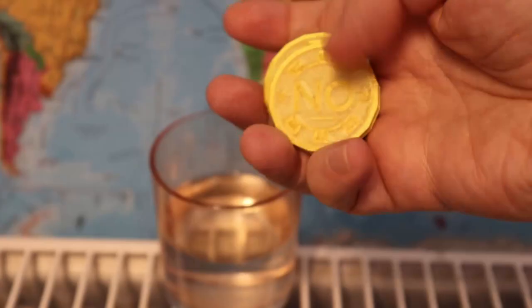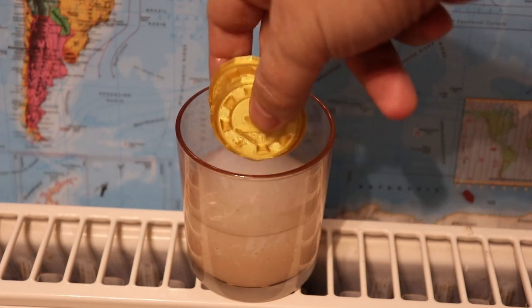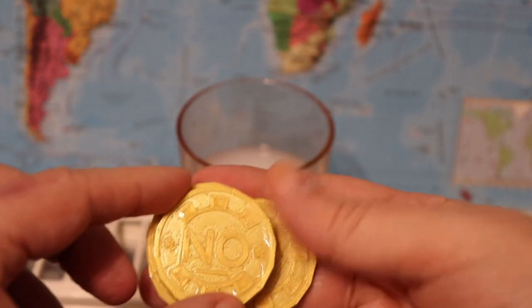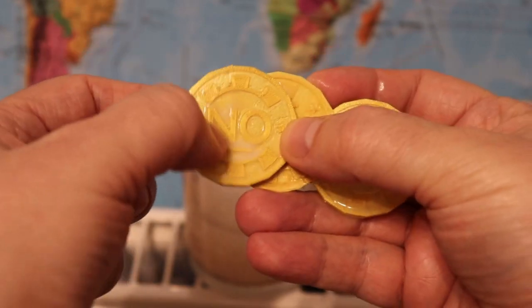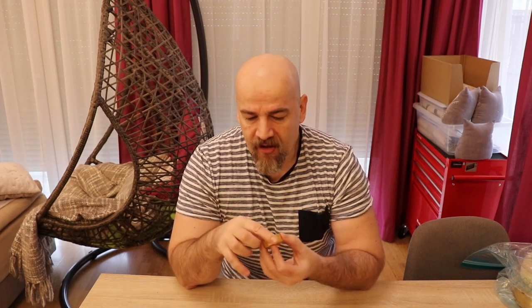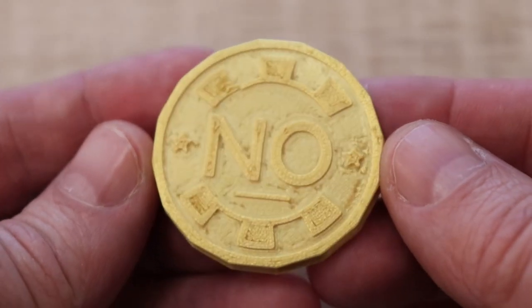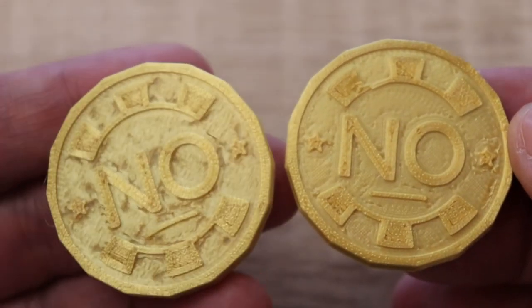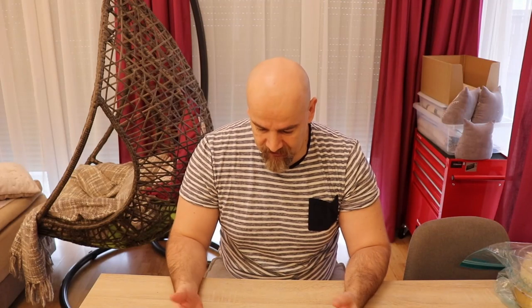Let's place all these coins into water. After three hours it's almost done. And here they are — version 2.0. The only difference is that the PVA is now printed at 195 degrees Celsius, and I can see a much better no-side background surface because I reduced the flowing of the material and stringing. But it's still there — so it's not perfect. Let's compare it with the previous version where PVA was printed at 230 degrees Celsius — it's much better, but I can still see those unequal spots in the background of the no side.